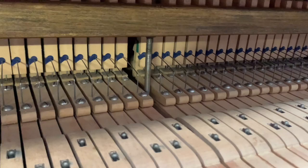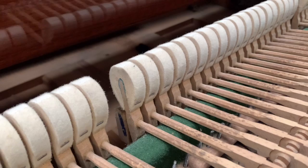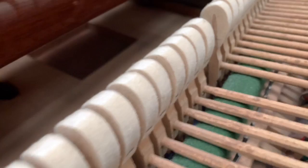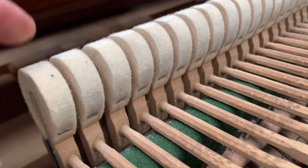Now it has the Blüthner patent action, which I've shown many times before, with the L-shaped spring here. This one has a normal style with little buttons and the jack here. The piano was re-sold by Blüthners in 1959 and there's not a huge amount of wear since. They could do with some light refacing but those hammers are pretty much 95%, which is very encouraging. The tone of them — they're very hard. I always check the hardness of the hammers by pushing so I can get my nail into it. Down here they should be soft and then as they go up they get harder, and then you voice the top of the hammer very gently.